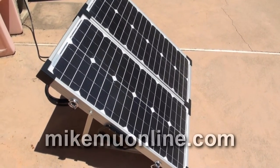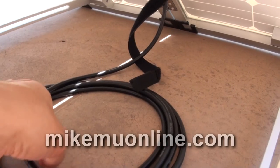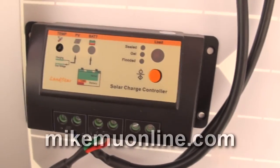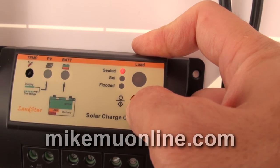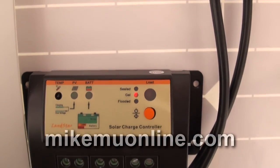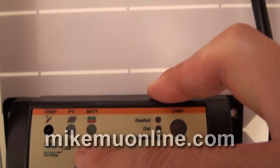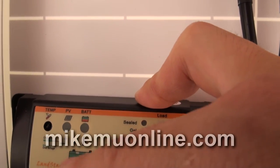I have it installed outside here on the concrete patio backyard, and the 16-foot cable is actually fairly nice to have. You'll want to cut it off — use a knife because it's got this zip tie here. Here's the controller. It's important to note that you should read the manual before setting up anything like this. What I had to find out was that to set the battery type, you hold the button down for five seconds until it starts blinking to switch to the correct one. I'm holding it down right now. I'm going to switch it down to gel. I believe I just leave that alone, and after a couple of seconds it'll standardize on gel.